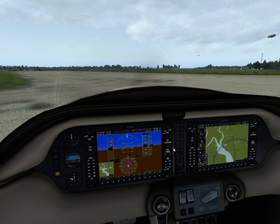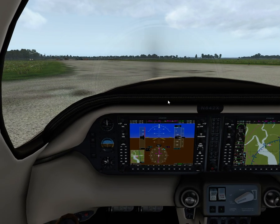I'm just going to run the takeoff checklist before so we know what will happen. Landing lights on. Wing flaps, takeoff position, mixture full rich, backup fuel pump armed, pitot heat and propeller heat as required, throttle advance slowly to 2600 RPM, watch manifold pressure indicator for overboost, elevator control lift nose at 75 knots, climb speed accelerate to best rate of climb at 110 knots, wing flaps retract at 400 feet or above, 95 knots. So that's what will happen. First we'll release the parking brake and we'll go.